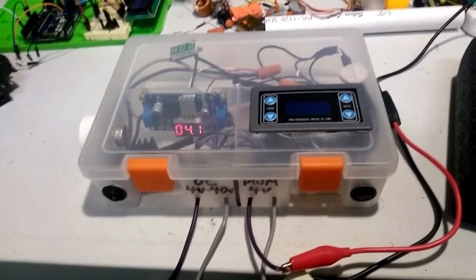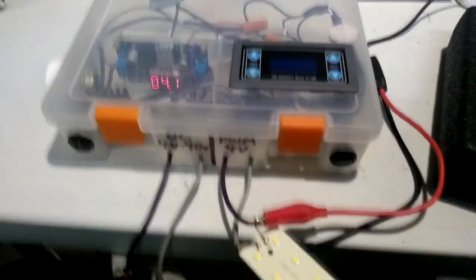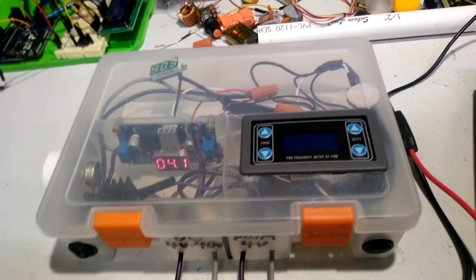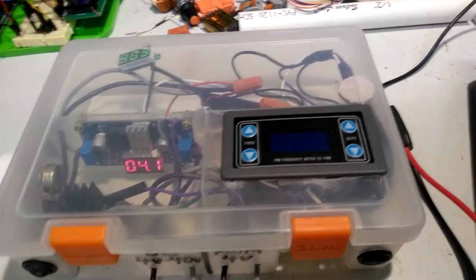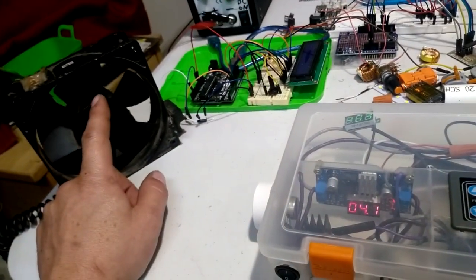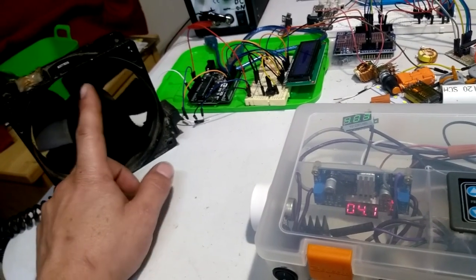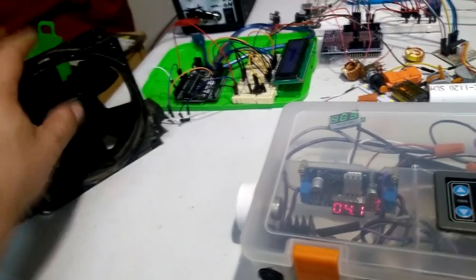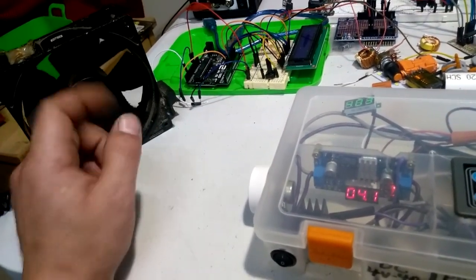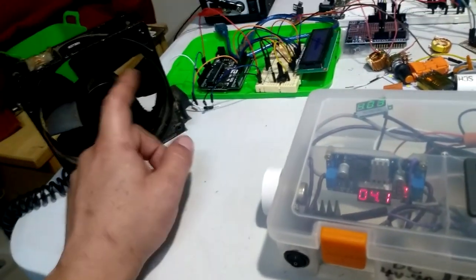So just tinkering around, I was like, okay, well, let me see if I can get the output here to match that to get the same effect. And what I noticed was a kind of cool little way to visualize how the pulses work. One thing I've noticed with joule thieves, they always work for that application with this little fan that I was talking about, because at those frequencies the duty cycle is very low. You've just got quick spikes, and it gives you a really good visual effect.